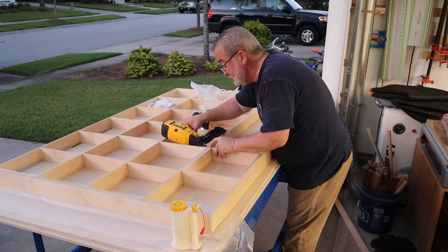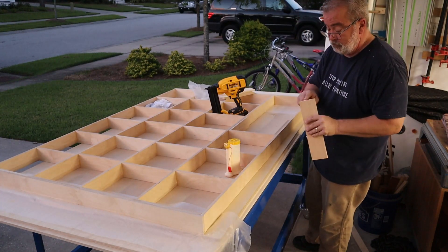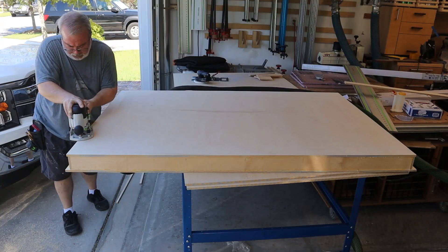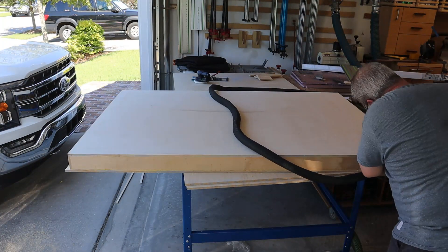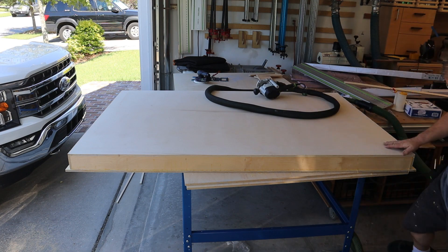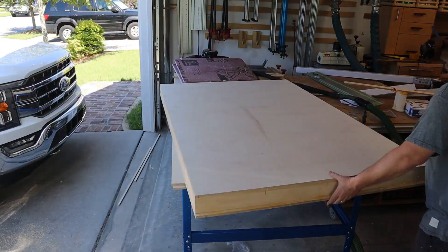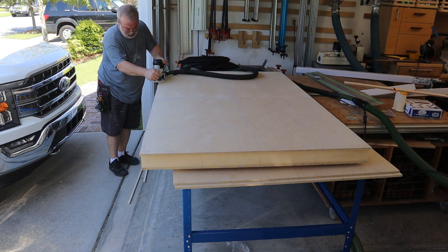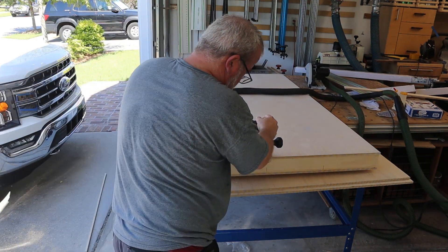I missed it in the footage, but you're just going to slap some glue on the top of all these ribs and put an oversized piece of plywood on the top and the bottom. Then we'll use a flush trim router to clean up those edges and give a nice appearance — which is what's happening here. I left it about a quarter of an inch heavy on all sides with the intention of coming back with the flush trim router. Using half-inch Baltic birch came in handy, but even though it's only half inch this thing is still heavy — approximately four sheets of plywood coming together. A quick flip and flush trim on the other side, and this thing is all dialed in.